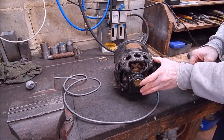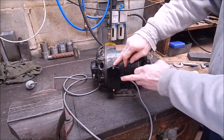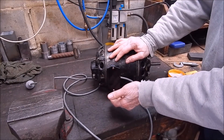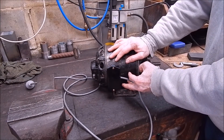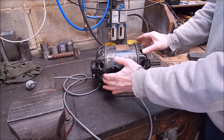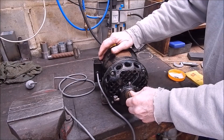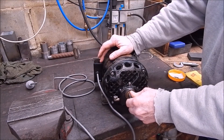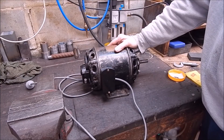She goes good. One other big thing on this — where the wiring went in, the wiring was terrible. On these, the four wires that come out just hang there in the middle of nowhere and they're flexing around; it's a shocking arrangement. These would have been wired into a junction box which is probably nearby. So I had to re-insulate the wires, and I made up a junction box to go on it — it's all fabricated completely. I did that with the Bullfinch torch — once again, this is where bronze brazing is fantastic, because this sort of work you can do it; it's only thin gauge stuff and you can do a beautiful job. That was all just fabricated by hand using the LPG gas torch.